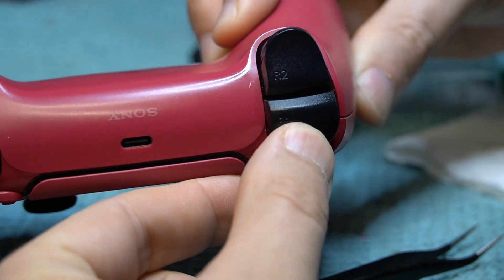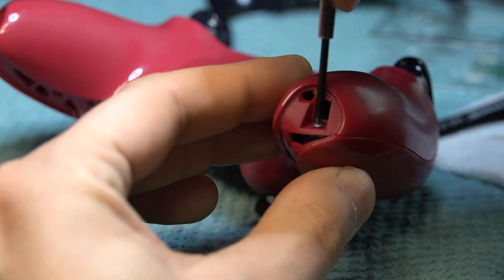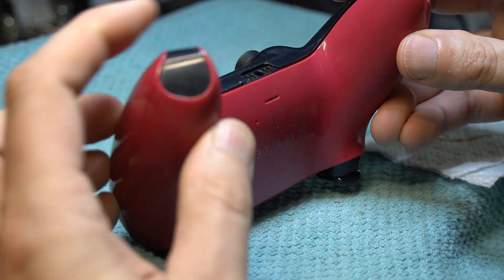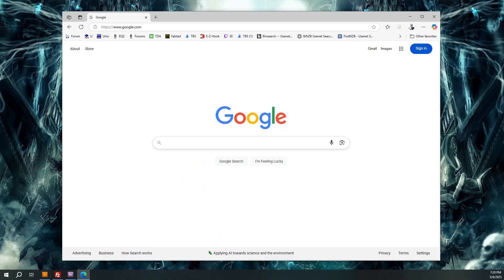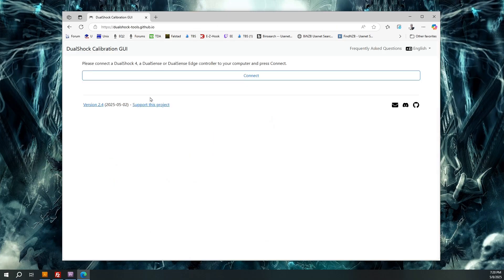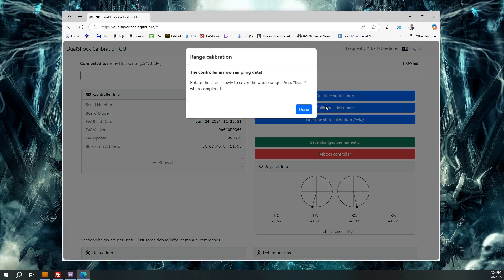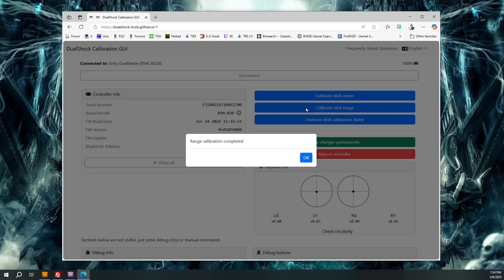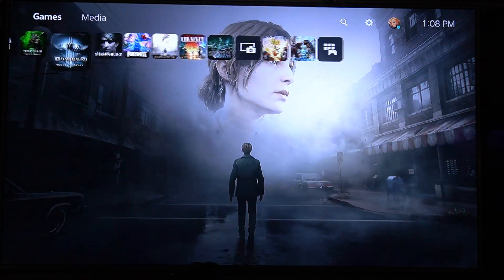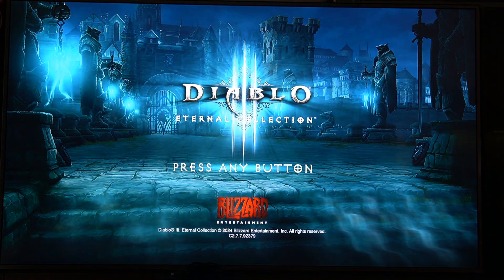I fully expect to get blasted in the comments because I'm showing the wrong way to solder. But if this video helps just one person avoid a controller horror show and instead they successfully upgrade their gaming controller to new joysticks, I will have accomplished my goal and I'll be happy. Once I had the controller back together with the new joysticks in it, everything snapped into place, all satisfying. I ran over to the computer, connected with a USB cable, and went to a great website which lets you calibrate the controller — you go through step-by-step, set your extents: up, down, left, right, then do the sampling of the data to get your correct analog controls. Once the calibration was complete, I fired up my PlayStation, logged into a favorite game, and everything seems to work. Hopefully you have the same results — if you don't, by all means leave a comment or send me a message and I will respond if I can.